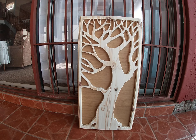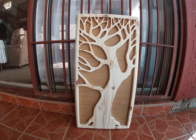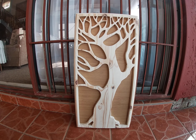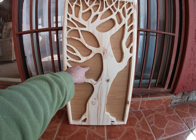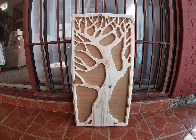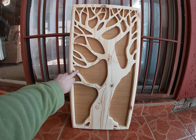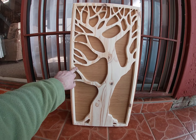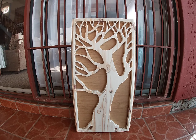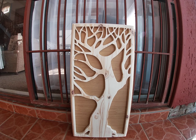Luckily, I was in the vicinity to press the emergency button. And just again, it just shows you — you've got to have an emergency stop button. I had my zeros set up, and I could go back and get my X, Y back. But I ran a V bit after the initial cuts, just to give me an etch and to clear up the burrs. But I was slightly out.